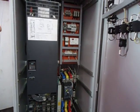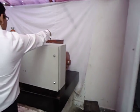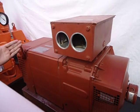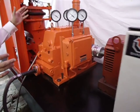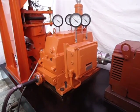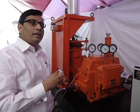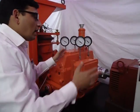This standard Siemens 110 kilowatt drive panel controls the speed of the motor between 0 to 5,000 RPM, and the gearbox multiplies it up to 70,000 RPM. 70,000 RPM is a very high speed, and the gearbox has been designed considering the vibrations that might come, with detailed engineering analysis completed.